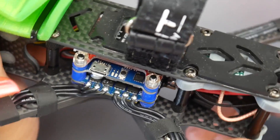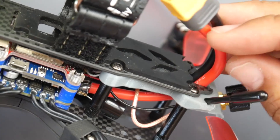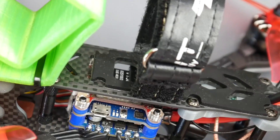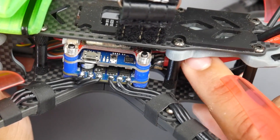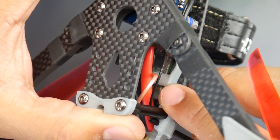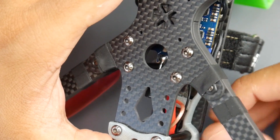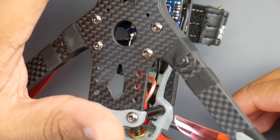A culprit of noise, if we still have it, would be the very long battery wires which can introduce a lot of noise - you might want to trim those down. There's also a 3D printed part holding the XM Plus radio receiver. You can easily bind it without taking everything apart because the bind button is right there. Off USB the receiver won't boot, so you'll need to use the battery - make sure your propellers are off, hold the bind button, then plug in the battery.